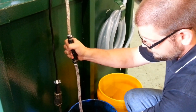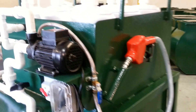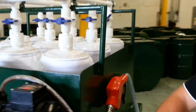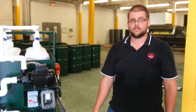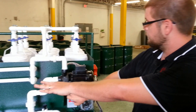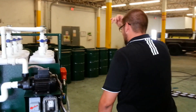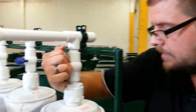All you're going to do is open this up, make sure your line is in the oil, and prime it. As you do that, you'll actually hear it pushing the air out of the lines. Give it quite a few pumps — you can hear the oil pushing all the air out. Once you've done it quite a few times, go over here and make sure you turn this off. If you do not turn this off and your line is not in oil, you're going to suck air and have to start all over again. Now that we've got this all open, we're going to go ahead and turn our motor on — pulling from our filter tote. You can hear the motor caught. All the air is out of the bag, and if you look in here, you can actually see it's now taking the oil from our tote and pressure filtering it through here.